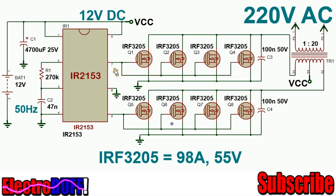When the high-side is high, meaning there's a high pulse at pin 7, the MOSFETs Q1, Q2, Q3, and Q4 will all conduct and this will allow current to flow from VCC through the left side of the primary winding, through these MOSFETs into ground.